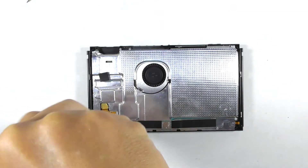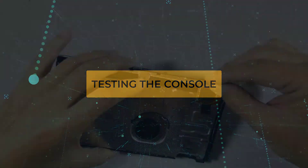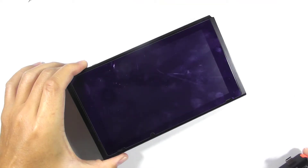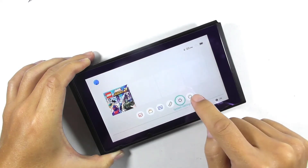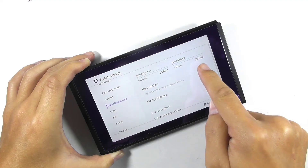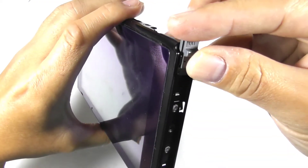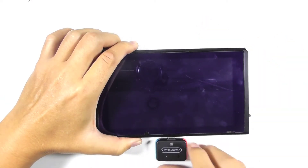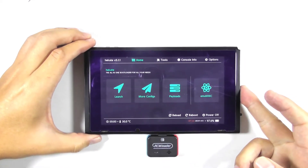Let's screw the card reader down. Insert the micro SD card into the console, then turn it on. There's no freezing and the loading time is back to normal, and the SD card is detected by the console. Now turn off the console and get into RCM mode, then inject the Hekate payload. It is now booting into the Hekate menu, which means the repair process has been successful.